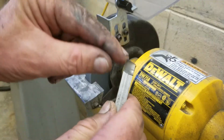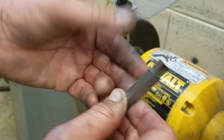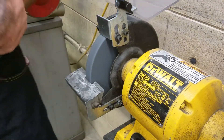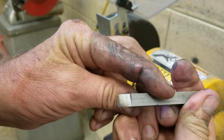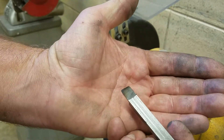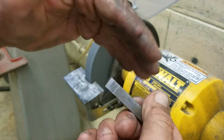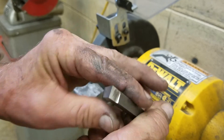For our finishing tool on the other end, it's going to be the same tool as this but with a little radius on it. Let me show you how to put the radius on it. That's all we did to get the radius — now you can see we have a nice little radius on it. All my angles are right. It's only taking about 10 minutes. I don't put a back rake on there, so don't do that. My end relief angle and all other angles are 10 to 12 degrees — that's exactly what we do.